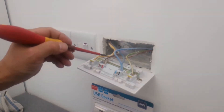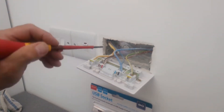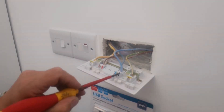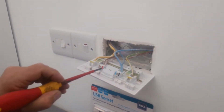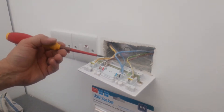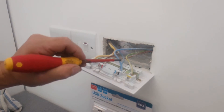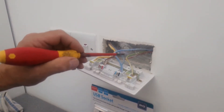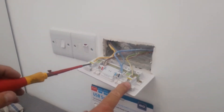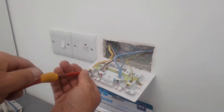You'll see this is the live, this is the neutral or line conductor, and this is the earth. You'll find it's got the new colours and the old colours. Black and blue, which is neutral. Red or brown, which is the line or live conductor. So in older houses this one will be red and this one will be black, but in modern houses you've got blue and brown. And then these two here are your earth conductors or CPC.